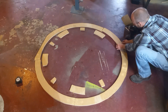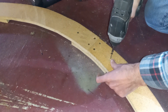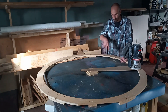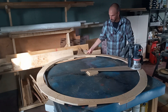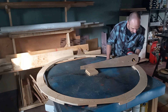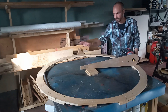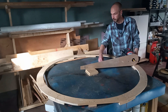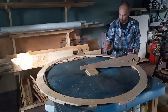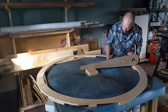These are just going to be kind of risers. We got the circle all mounted down to the table — we ended up just screwing it down in some spots and it seems pretty sturdy, it's not going to move around a whole lot. At this point I'm ready to start using what I think is a 1.5 inch straight flute cutter. We marked out roughly our center and there's still about an eighth inch out of circle, so we're going to start at 25 and an eighth and see if that cleans it up. If it does, cool; if not, we'll bump it up to 25 and a quarter. Let's set this up and start cutting.